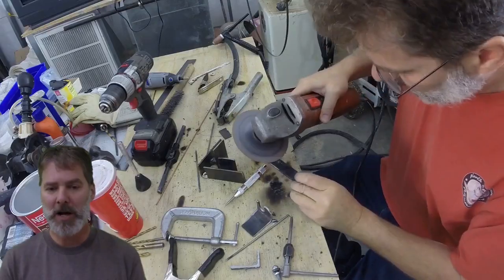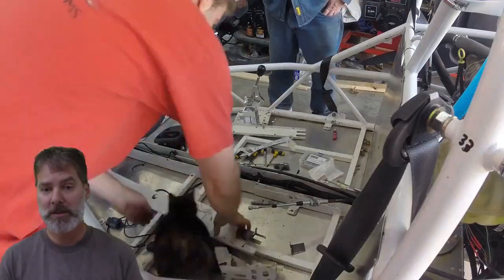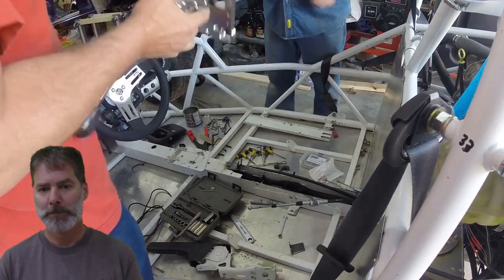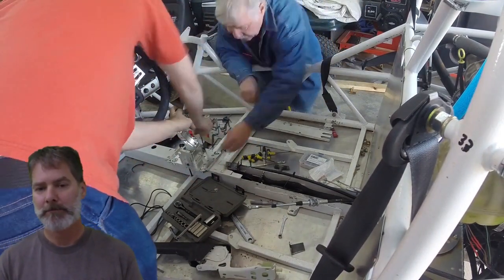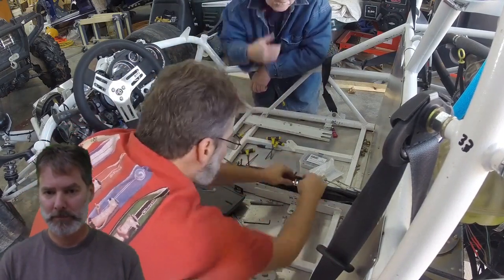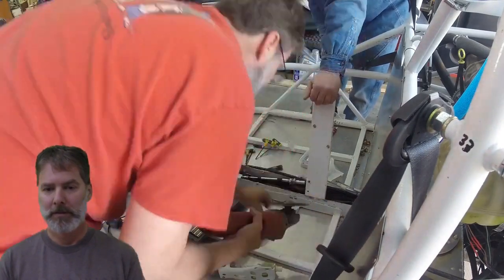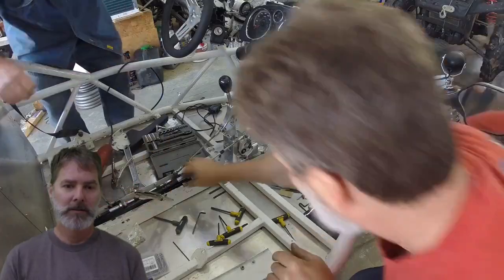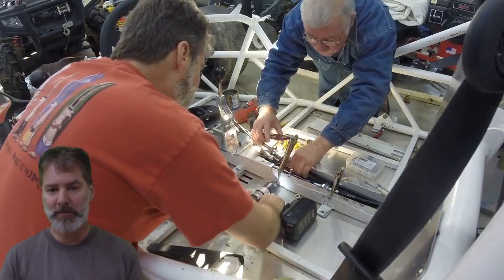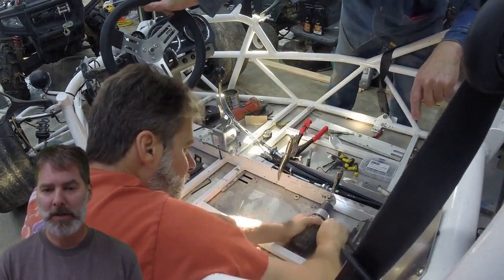Here we've added a second boss onto the connector arm, and that has the 6mm DF-supplied ball stud — a 6mm ball stud and a 5mm shoulder bolt that has 6mm on the shoulder. Here we're using the vice grips to help determine where the final positions are going to be for the connector arm and the cable mounts. Once we're satisfied with testing, we're drilling pilot holes to permanently locate where they'll stay, and we'll put bolts through there so they can't slide around anymore.